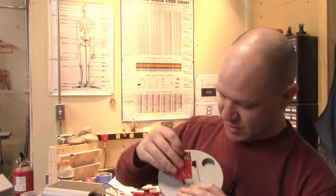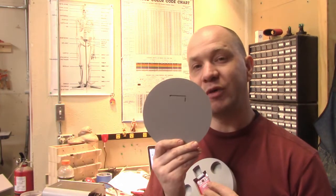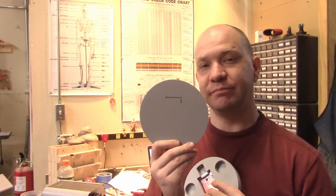This is going to be the RFID sled. This is the RFID reader holder for our reactor cores. And just because we have run into instances before where we're just kind of barely on that threshold, in the cut path, I went and put a little slot there that will receive those little bitty solder points to get this as flat as possible up in there, which will get it as close to the fuel rod as possible to do a read. Show that by itself. There it is without the rest of the thing.